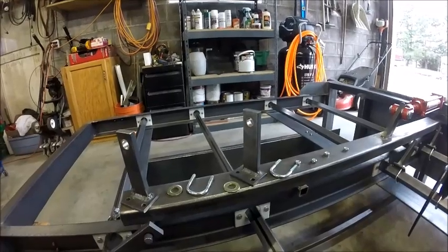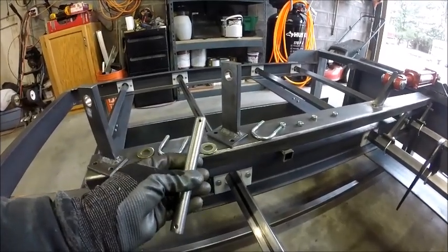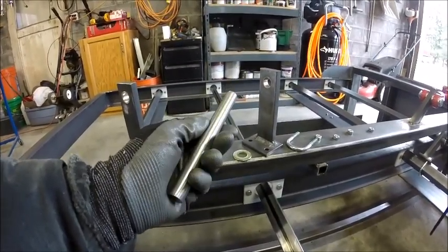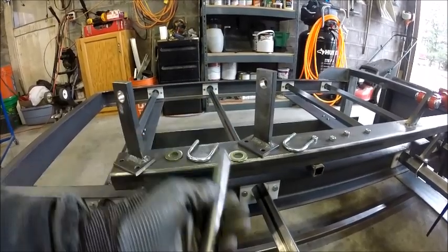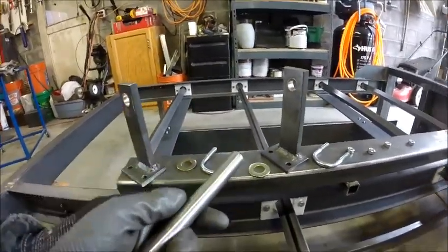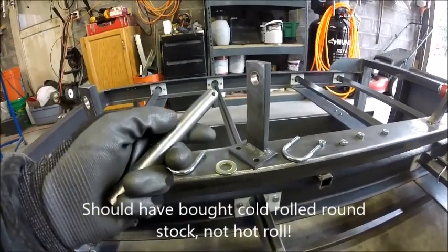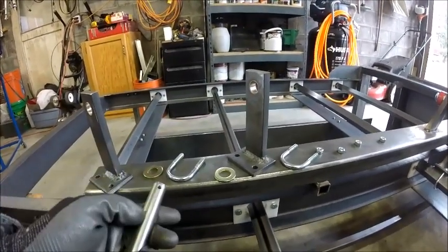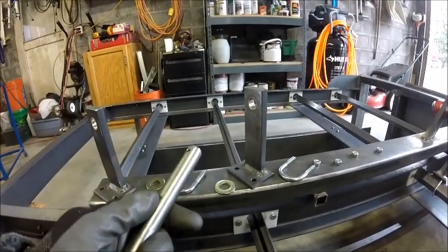This is taking way longer than I was hoping just to get this set together working. This slides through tightly but not getting stuck — it's been really difficult. This one assembly has taken me almost 45 minutes, going from a tacked piece to a welded piece, to pressing in the bushings, cleaning up the shaft to the point where it works, reaming out the bushings, drilling holes and chamfering them, chamfering the edges, cleaning up the slag. Today's going a whole lot slower than I thought it was going to, but it's going to get done and it's going to get done right.